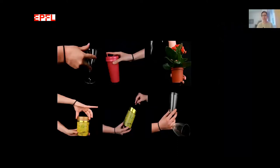We started by observing how humans handle objects. It happens very frequently that we don't put our fingers just around the center of mass, as is traditionally done in robotics. Depending on what you want to do with the object, you may place your finger differently — for example, at the very top of a lid to prevent it from opening. This is not the most stable grasp, but it's optimal with respect to the task. Similarly, suboptimal grasps with respect to stability can be optimal for handing over an object to someone else.